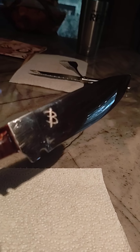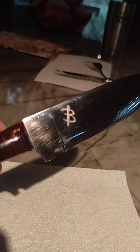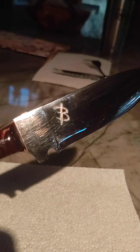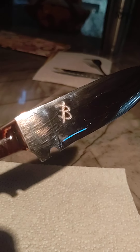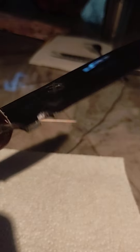It's actually burned into the blade. You use salt water and 24 volts — some people say 12, but 24 really puts a nice edge on it. I got a little mark right there I'm not sure about; I'll put it on the buffer after I put an edge on the blade.